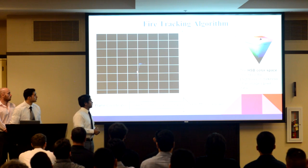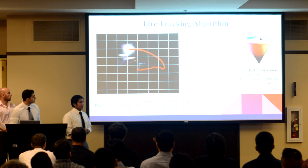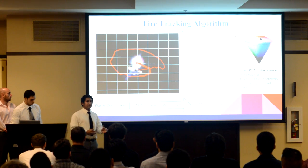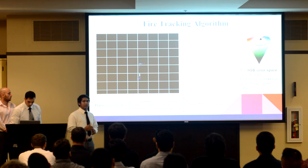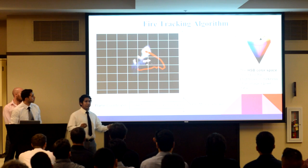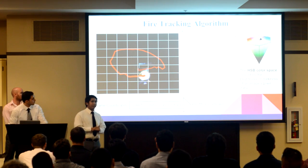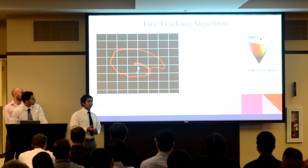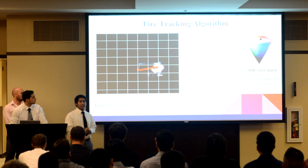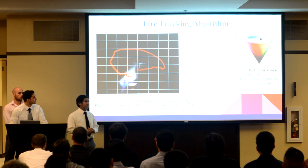Here's a demonstration of our flame detection system. In the background, this is a video feed that passes its frames to our traversal algorithm, in which the binary data is broken down into strings and the HSB range that we have defined for infrared light. It is used to find the largest pixel cluster, and a successful detection is exemplified by the yellow centroid followed by the red line.